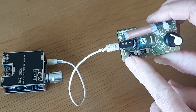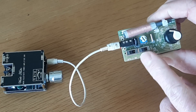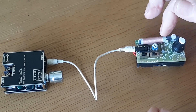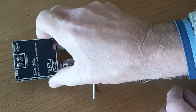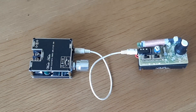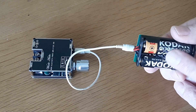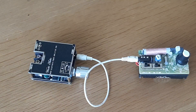I'll put a separate rotary switch onto the cabinet of the radio, and also the AM/FM switch which I shall disconnect and reconnect onto a rotary switch on the cabinet. The radio module output of this AM or FM - now it is a digital radio, but it has the analog tuner which caught my fancy - and this will be fed into this other module here, which is actually a 30 watt mono amplifier, again not that expensive, but it also incorporates a Bluetooth module to allow this radio to become something a lot more useful. However, to power these two modules I'm going to have to make a separate power supply, because the radio module uses two batteries - in other words a 3 volt supply - and the amplifier needs a 12 volt supply at least to give it any sort of woomph.